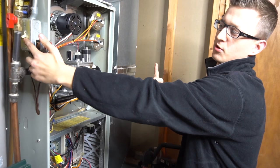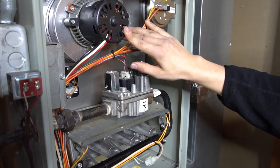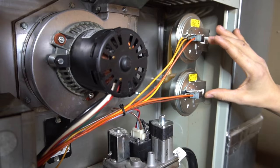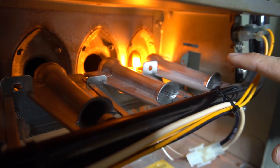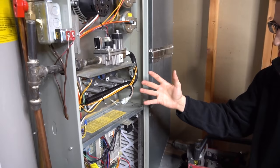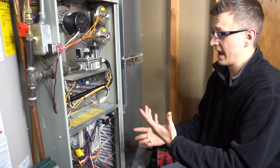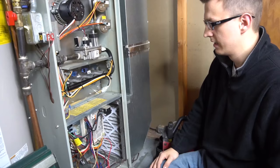Now let's turn the switch on — I have my thermostat calling for heat upstairs and we'll see the furnace in action. So the thermostat is calling for heat. The very first thing that should energize is this motor — the inducer motor turns on. You can't physically see it, but the pressure switch will close. And as you can see, my igniter is starting to glow — really bright yellow or bright orange. And then you're going to hear that gas valve click, the burners light, and now the furnace is going to be preheating for a while. Once it warms up the heat exchanger enough, the blower motor will come on and start distributing the air. The reason for that is if the blower fan comes on right away when the furnace is cold, you're going to feel cold air coming out of the vents instead of warm air.